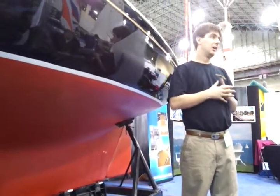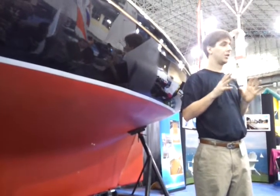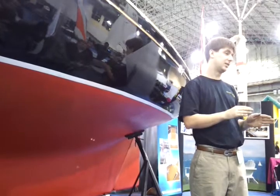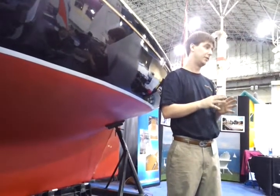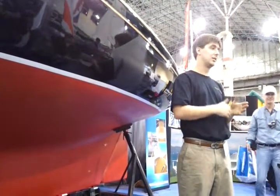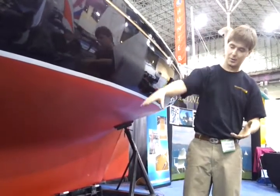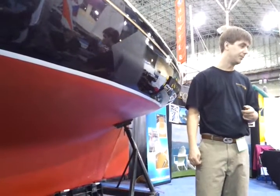On the hull, I haven't seen your boat, but I've started with this, a 600, which would be very, very aggressive. I haven't seen your boat, I'm not the one doing it, you have to be careful. If you use that 600 on the corners and edges, you'll sand right through. So you have to be very careful. You have to start out more conservative, and as you get practice you decide, oh, I can use a little more aggressive on this spot or whatever. And you start out with the most aggressive and work your way up to number three, if you want, as far as you want to take it.